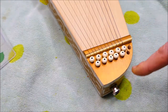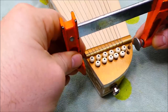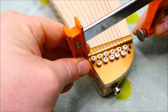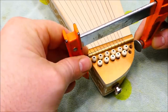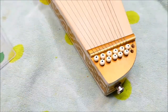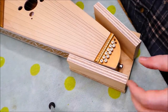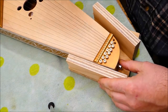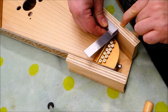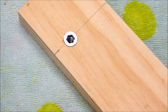Clamping an irregular shape like this is always a bit of a chore, especially if it involves a curved section. If I put a regular clamp across there, there's no perpendicular surface for the jaws to engage with, so they want to slide and the clamping pressure gets misdirected. So I've decided the best thing is to make a small clamping form — a little plywood frame with one wall already placed at right angles. I'll use a square to figure out the angle for the second wall, and position a quarter-20 insert so I can put a screw through and turn it into a press.